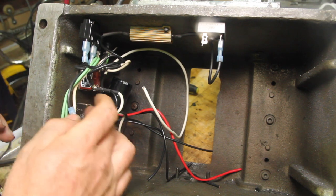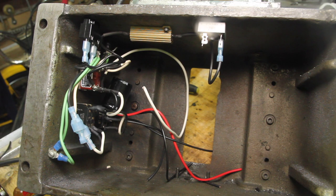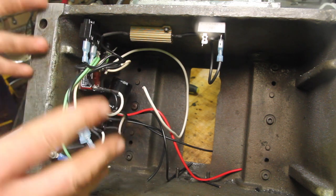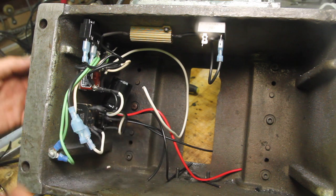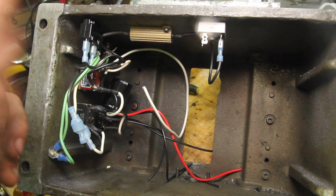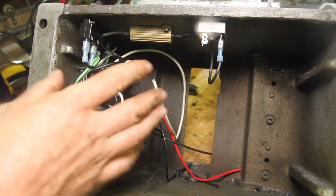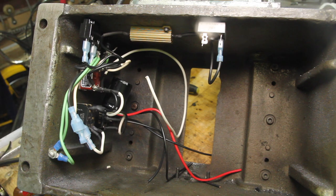I've got all of these switches oriented so off is to the back. I figure that if I'm in a hurry and I need to turn something off because something's going wrong, just hit it, push it back. And I also feel like if I'm bumping it by accident, I'm going to be a lot more likely to be reaching past it when I bump it. So I'd rather it turn off than turn on when I do that. I don't know, personal preference.